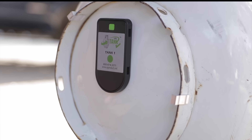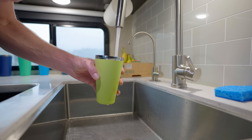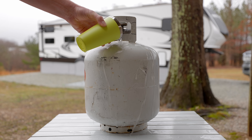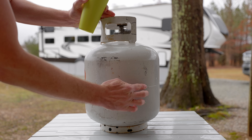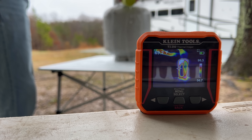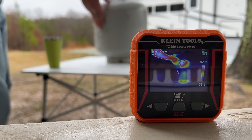Now for the hack with a cup of water — this is so simple. This is going to tell you exactly how much propane you have left in your tank. Yes, there are sensors and technology for that, but there's something great about having something old school and free. You just put warm water in the cup — just coming out of the hot water heater, it doesn't have to be crazy hot — and pour it down the side of the propane tank. Where there's no liquid inside the tank it's going to be warmer than where the liquid is. Put your hand on the side and you'll know exactly what level it's at, simply by using a warm cup of water. So simple and works every time.